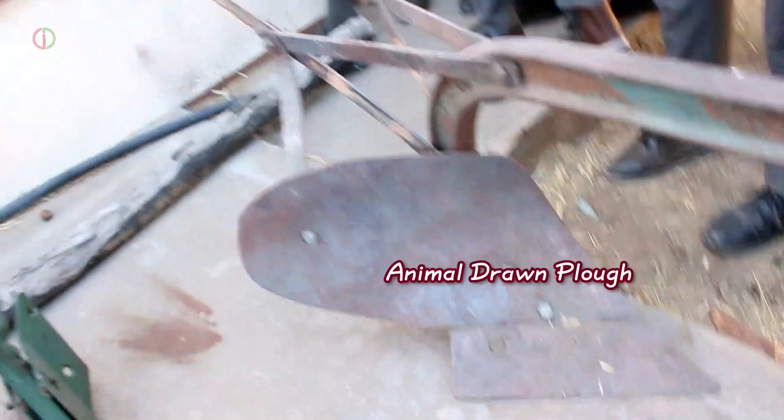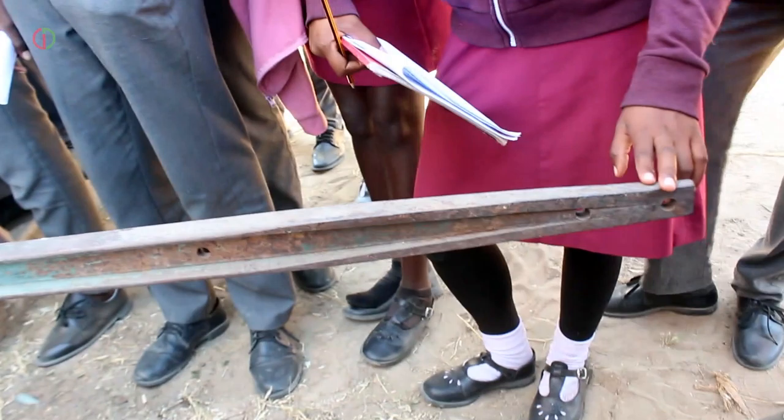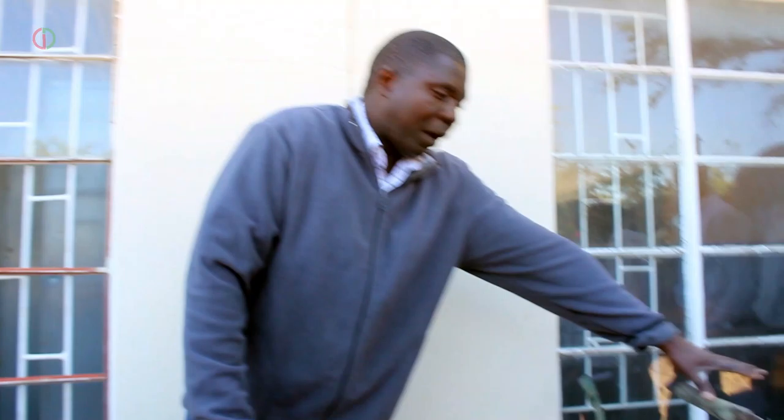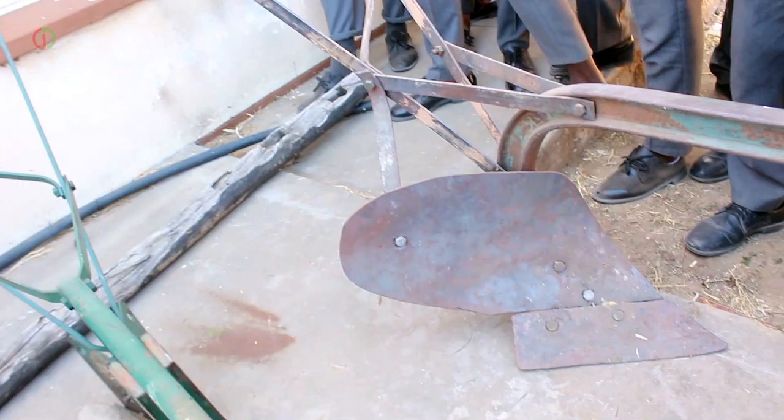We are bringing farmers to stay here at Mashare for 3 weeks, where they learn to make all the different parts of the plow. We dismantle one and only keep the beam and the frog. Then for the rest, we look in the scrapyard and make the parts. At the end of the course, we have a finished plow so that we can demonstrate. We don't use anything here, we use only fire. We put those things on fire and cut them with fire.